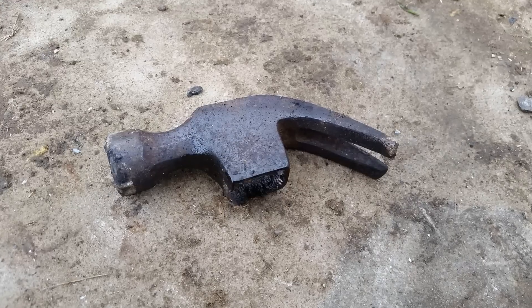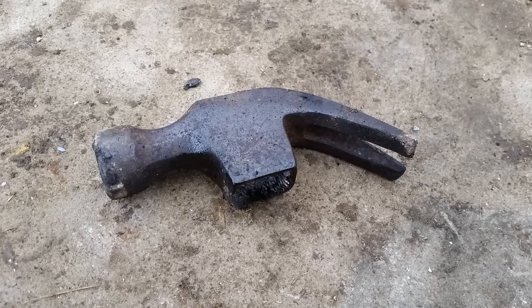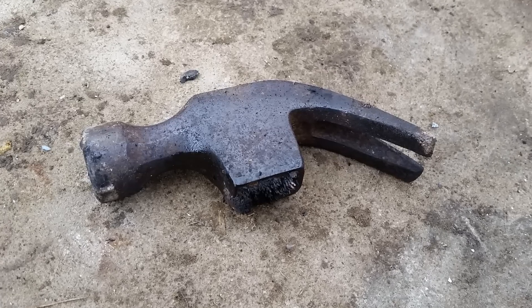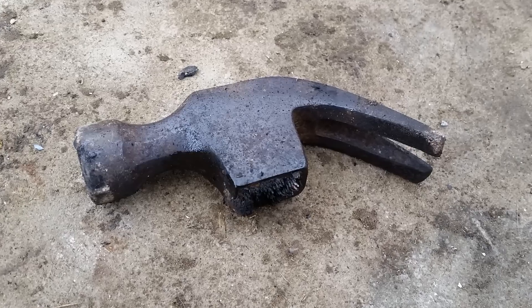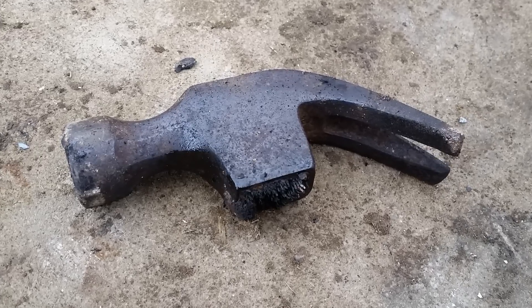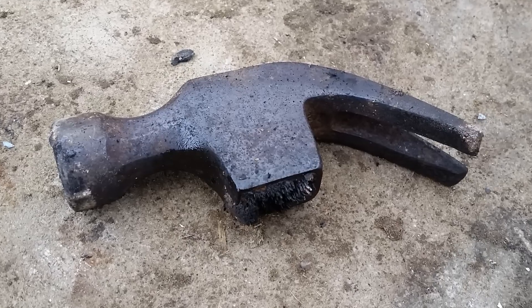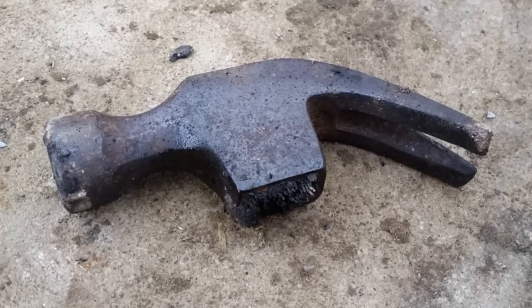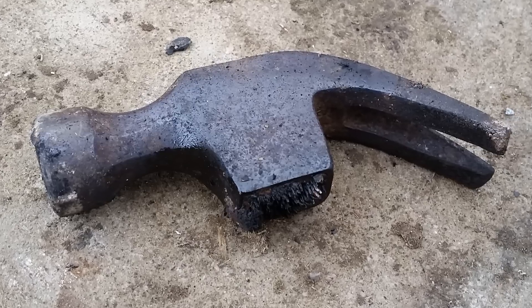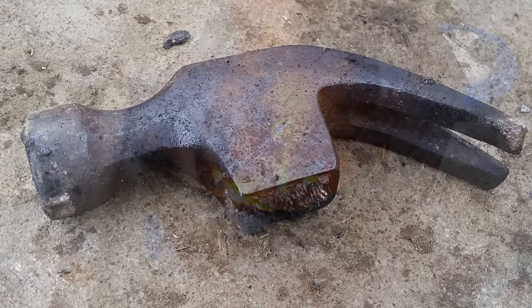The first step is to find your hammerhead, and it's actually quite important to pick the right one. Since this was my very first tomahawk to forge from a hammerhead, I decided to use quite a small one — only 30 ounces, which in relative terms is quite small. It's a claw hammer, but ideally you'd want to use a ball-peen hammer. I used a scrap hammer I found on a friend's farm. This is quite an old tool and it's made from hardened, very high carbon steel — a file wouldn't be able to cut into it.